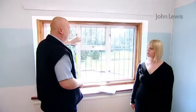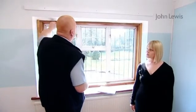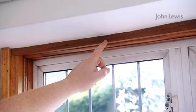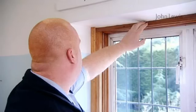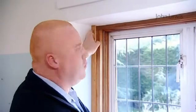Sure. First thing you need to look out for is where the blind is going to be fitted, and that can be decided by a number of factors. You've got to look for window handles projecting so that the fabric doesn't catch on the handles. You also need to look for the fact that some recesses aren't perfectly square, and this isn't. Now with this particular window, we have quite a low spot here, so the best place to fit the blind to will be the window frame.